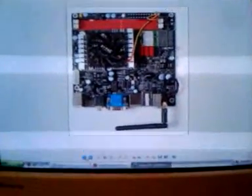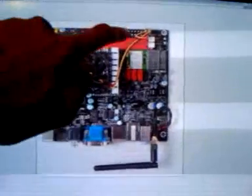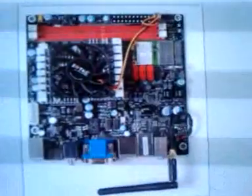Here is a motherboard that uses the Ion Atom processor. It's very small — this is on a Mini ITX, of course. Pico ITXs are a little bit smaller than that. As you can see, this motherboard is very compact. Here it is a little bit bigger — sorry for the blur, I am on my G1. You see these streams going up and down because this camera is not the greatest. But you see there's a cooling fan here, and we have two DIMMs of DDR2 RAM. Here's your 20-pin power connector. This is from Zotac, by the way. Make sure if you are going to purchase this, you want a really small power supply, because it's not going to need that much — it's only a 20-pin connector. Three SATA connections.